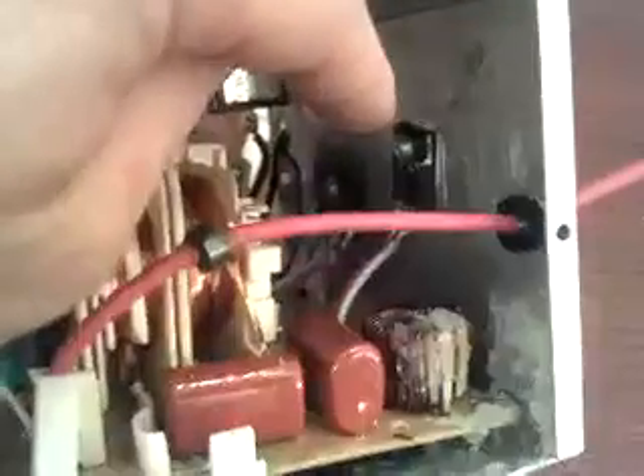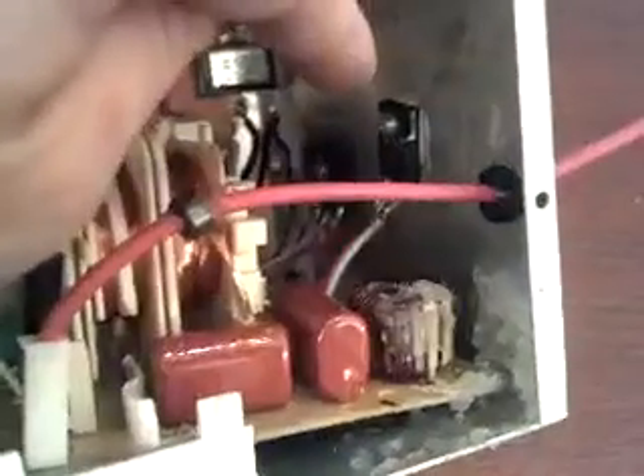The only other thing I did on the board is remount the two power semiconductor devices. Back there towards the back, you can see the bridge rectifier for the mains input. I just mounted that directly to the back of the case by drilling a hole through and mounting the original heatsink on the outside. That's an isolated case device, so there's really no difficulty doing that at all. The other device is the switching device — a high voltage, high current IGBT — and that one has a little problem associated with it. It's not an isolated case, and it is not isolated from the heatsink in the original installation. There's no thermal pad, nothing.